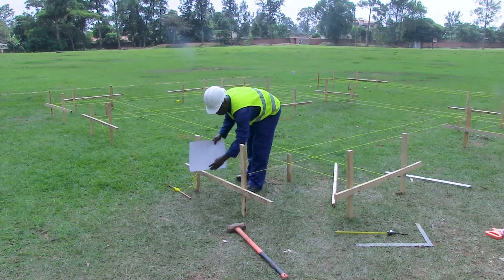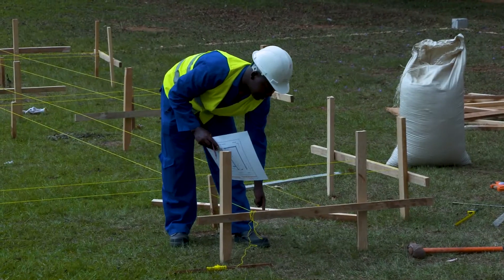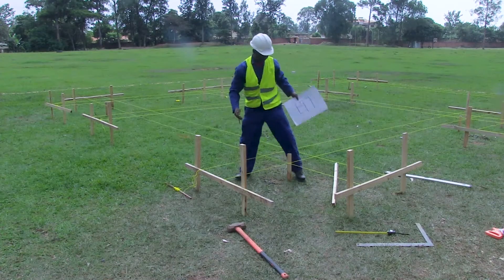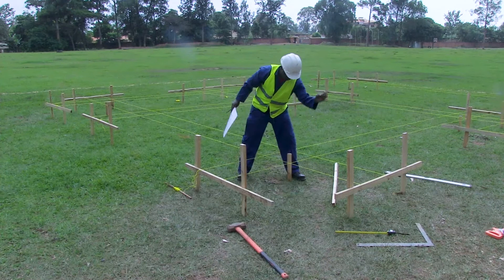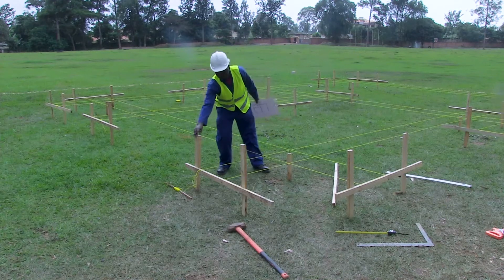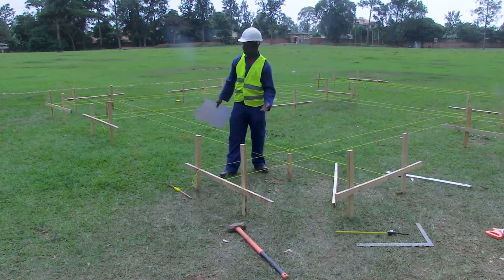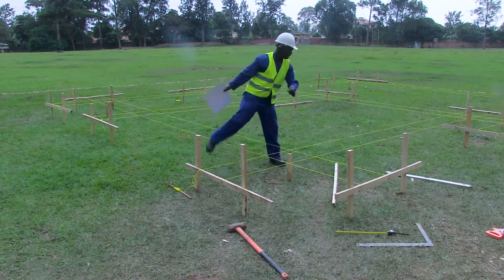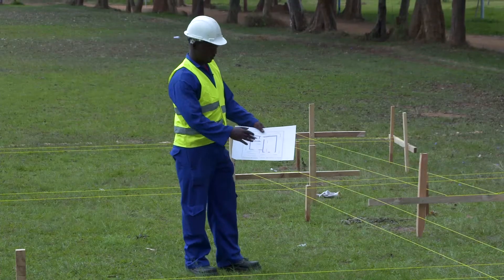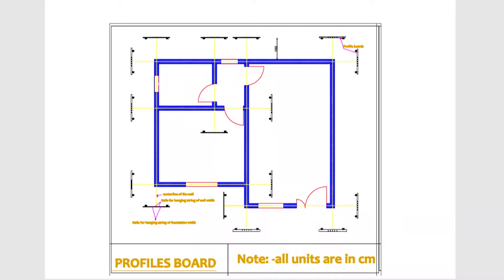This thickness will also be the thickness of the trench where we dig. On the profile board we have the measurements of the wall — the thickness of the wall and even the center of that wall. This profile board, as I said before, must be extended beyond the center line so that if we dig these trenches, they will not affect those profile boards, because those profile boards must remain there after the foundation is finished. I want you to check the plan on the ground and compare it with the architectural drawing.